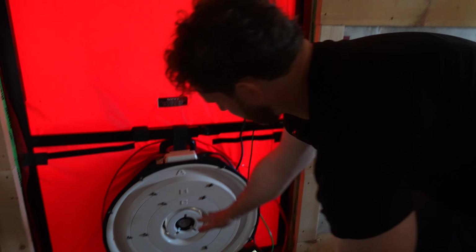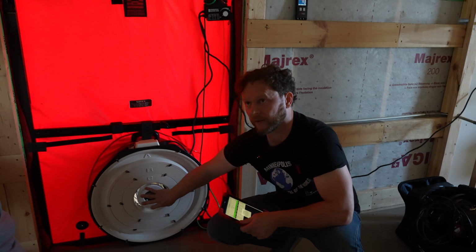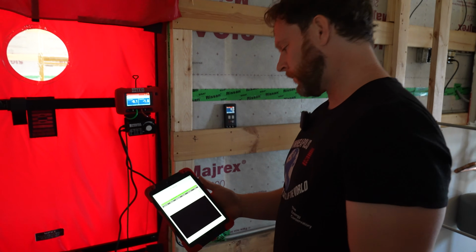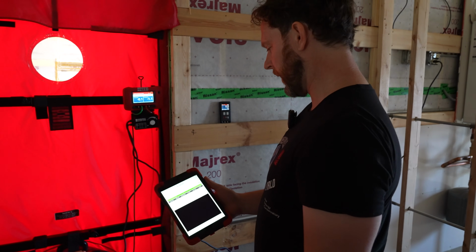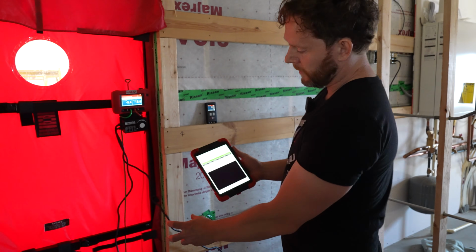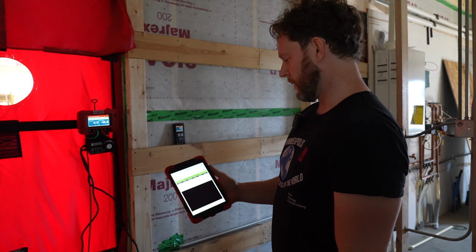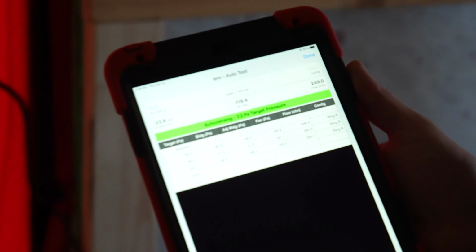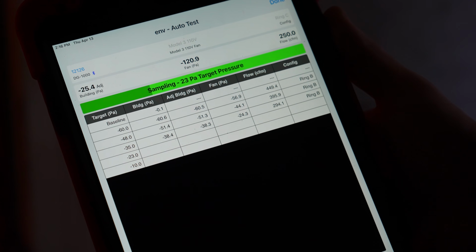The geometry of those is to keep the pressure at a high enough range right around the sensor here. So hit continue. The app knows that we switched rings, so it'll auto update the ring. We'll bring it up to pressure now. And now with a smaller volume, the fan will have to pull harder, keeping the pressure high right around that flow sensor. So now we're getting dialed in. 23, there's our target pressure here. So it's zoomed in, now it'll sample.